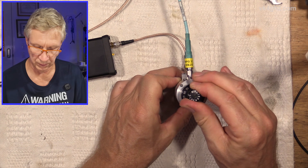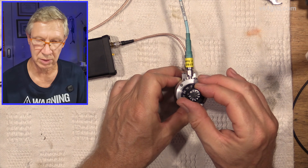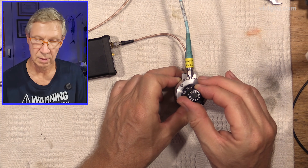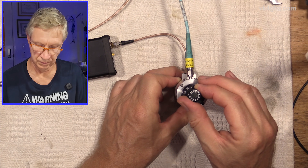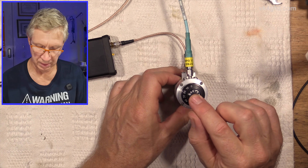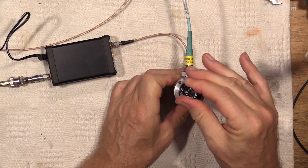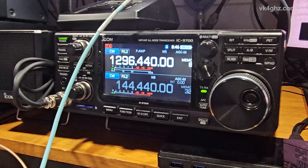It stopped working at 10dB. At 9dB there's a little bit — not quite strong enough. So I'm going to call it as 8dB. We've got 8dB of headroom. As you can see, the Minikits GPS9700 works really well with the Leo Bodnar injection board. There's no soldering involved — it's simply a screw-in device, so you can easily remove it and return the radio back to normal, and no one would know. That's an interesting little experiment. Hope you got something out of that. Thanks for watching, see you next time. Cheers.